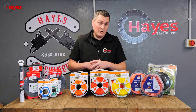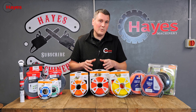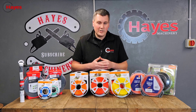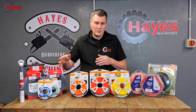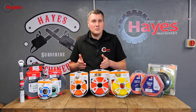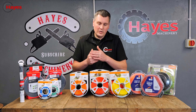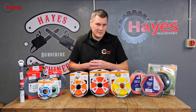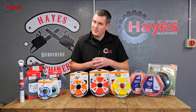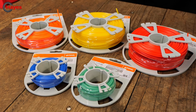We'll start off with the round trimmer wire. The round wire is the most cost effective and there's a lot of it on the market. We stock a range from several different manufacturers. It's a really good trimmer wire for domestic applications, usable on all different sized trimmers. For example if you're using it on a battery trimmer you'll be looking at the smaller range — 1.6 or 2mm. For petrol below 25cc you'd be looking at 2.4mm, possibly 2mm. Anything above 25cc is when you look at 2.7mm, and the 3mm is really designed for machines over 45cc. Once again, refer to your manufacturer's handbook for the correct sizing. To preserve your trimmer wire, it's always best to put it in some water and cover it over, leave it for about 24 hours or overnight, and then the moisture stops it from going brittle.